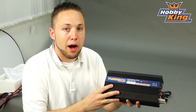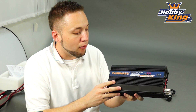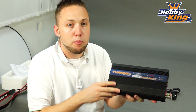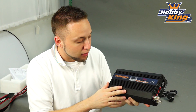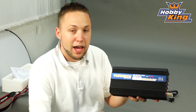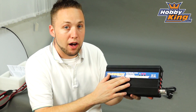This is great for your high power chargers such as your 500 watt chargers. Many of those high wattage chargers can only produce that high power output with a 24 volt or greater input voltage, so you can achieve that with this. This is up to 50 amps as well, so 24 volts at 50 amps — very powerful. It's up to 1200 watts continuous power.